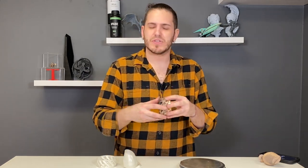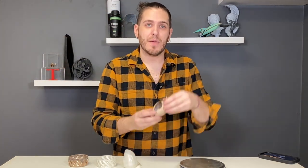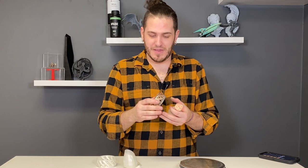I think you could probably get away with going one-to-one but adding about 15-20% on top. It's also typical practice to add about 10% for the button — that piece of metal on the back. You always want a little bit extra on top, because the metal, even though fluid, has weight and pushes down to help fill all the gaps while the vacuum pulls around it. I think the button on this cast saved our butts, and it was a success.